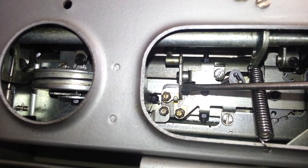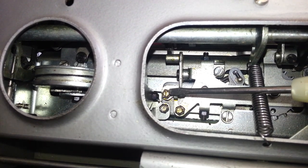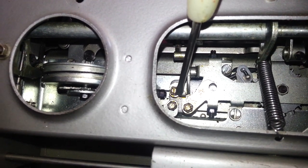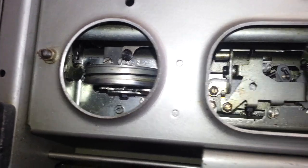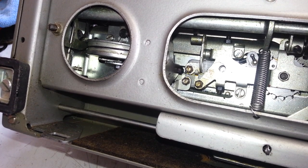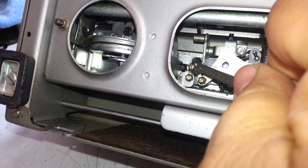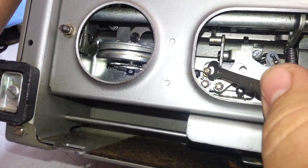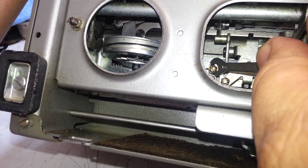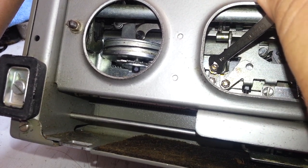And if we look at this, it looks like that screw has to go in. And that's going to make this trip sooner, which is what we wanted to do. We wanted to trip sooner. So I'm going to loosen that nut. It's going to be hard to do on camera here, but I do know that's a 5 on the metric scale here. Got it. Okay.